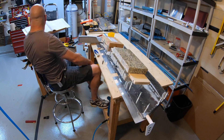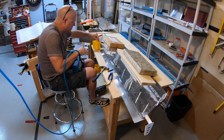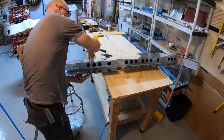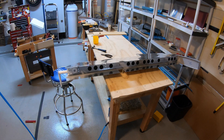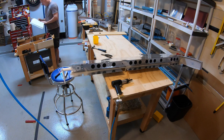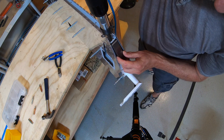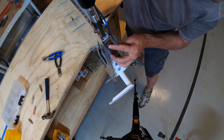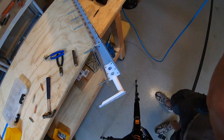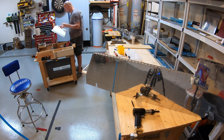The elevator horn is already applied. Back to it getting the ribs put together with blind rivets. I've got a little extra weight on there to keep everything in place and lined up. I was using the Harbor Freight pneumatic air riveter for those blind rivets - it's fantastic, no problem so far. A couple more rivets there on the rear spar, and you can see the hinge for the trim tab on the elevator in place.